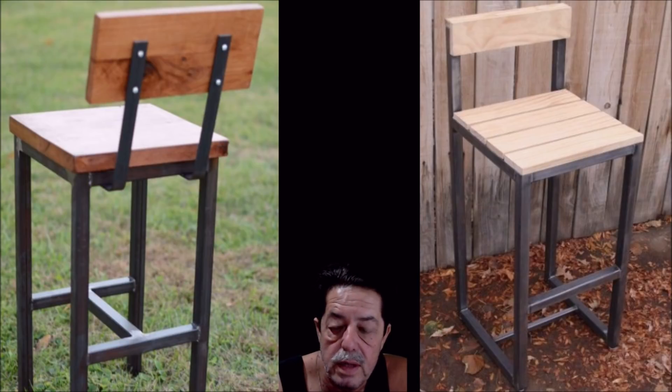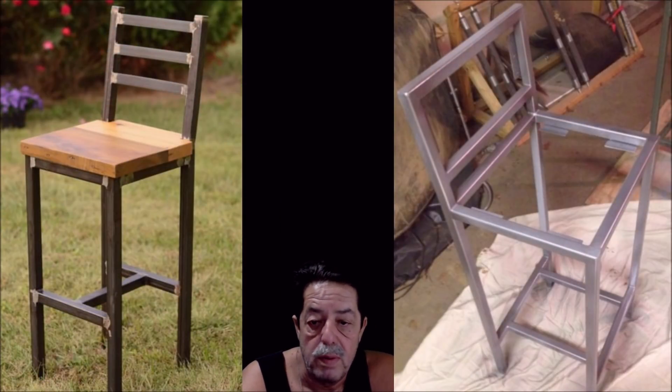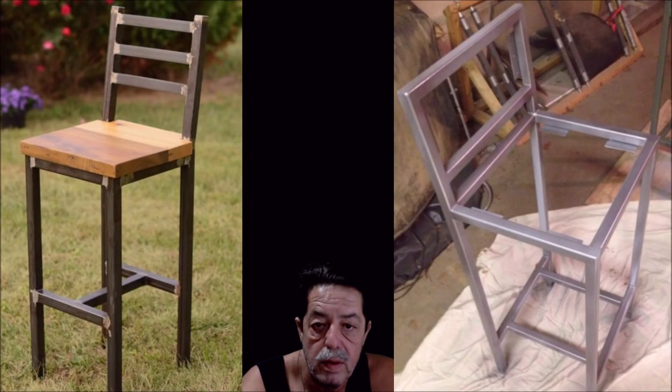With a little bit of pre-planning it's not that hard. I encourage you to show these to people on your phone — you'd be surprised how many will start buying them. On the left he used flat steel to create bands for the backing. If you look closely where the tube steel comes up for the back, it's at just a slight angle going back — not perfectly vertical. I've seen people make it totally straight and it looks okay but it's just not that comfortable.